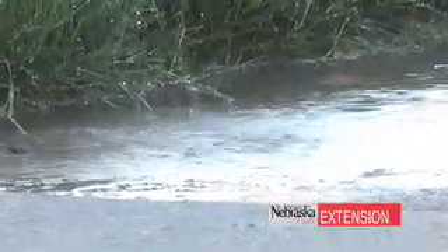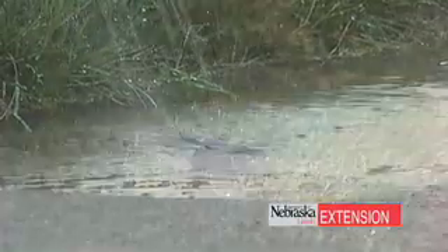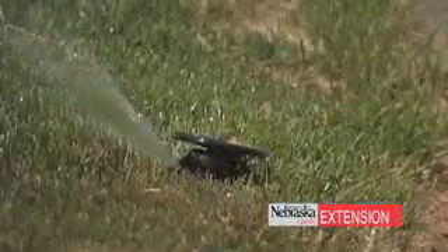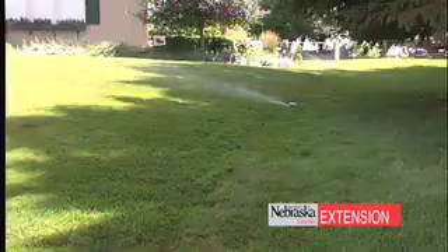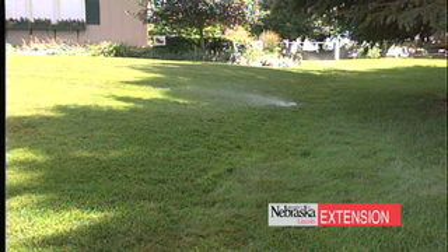One of the things we really need to be concerned about is nozzles. Nozzles tend to clog — they may precipitate calcium and magnesium from the water source depending upon where you are in the state, and you need to clean those heads. Sometimes it's as simple as putting a toothpick in there or using a knife blade to scrape the debris out. But if it's something a little more serious, like salt residue, soaking them in vinegar — if they're metal heads — will often open up that head without destroying the orifice size and ensure the distribution of moisture is as directed.